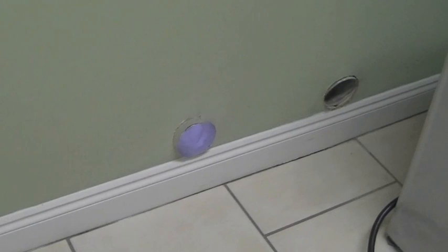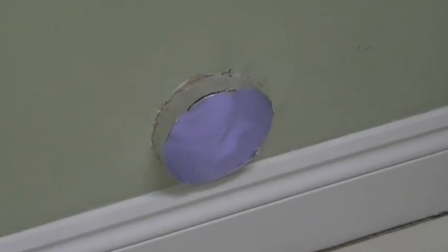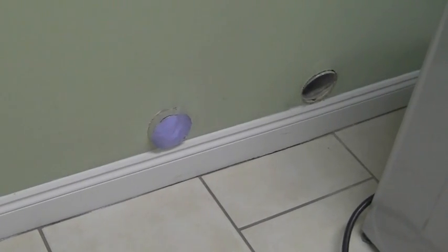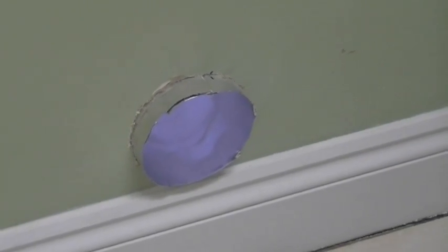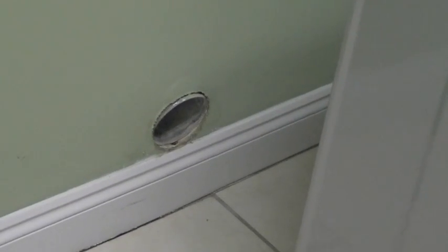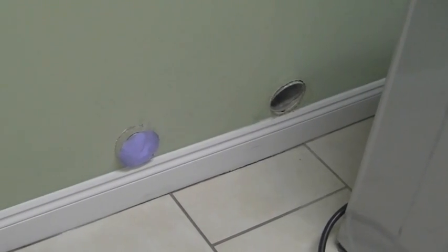Okay, what I've done thus far is I've installed the tube through the wall, and I've cut the excess off from the inside. So you have about 1 inch, give or take, sticking from the wall, because the extending telescopic ventilation tube going from the dryer to the wall will be inserted inside. That'll give it a better look, as close to the wall as possible, without the big 4-inch tube. I also removed the excess from the existing tube, and hopefully I'll be able to seal that up some way, shape, or form. So anyhow, I think we're just about done.